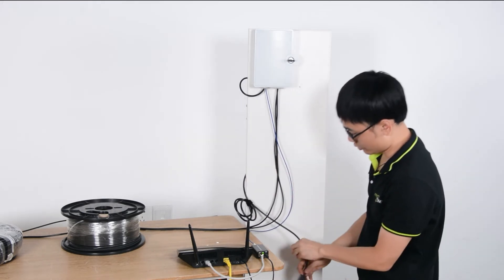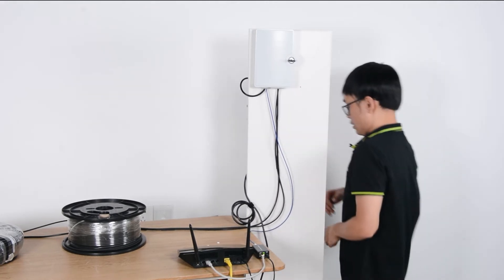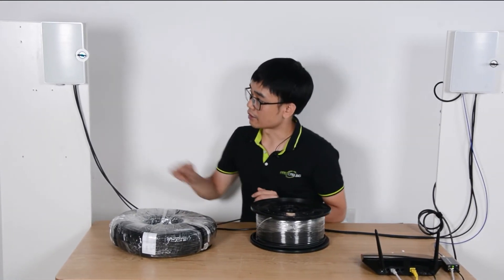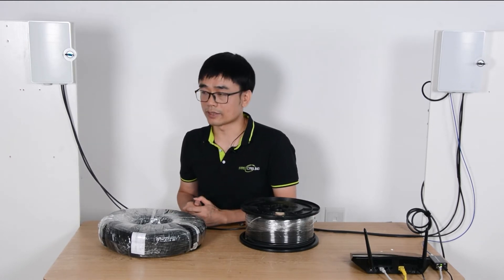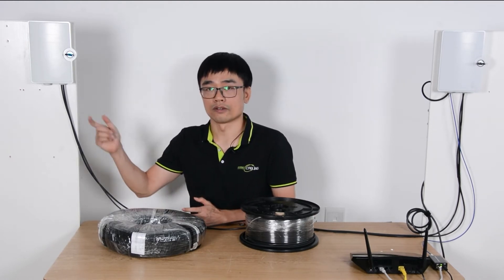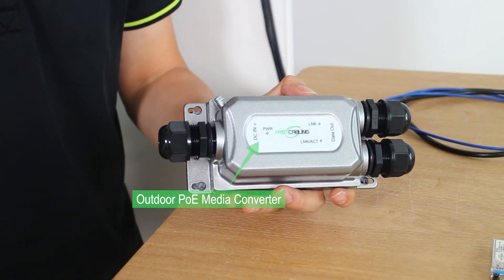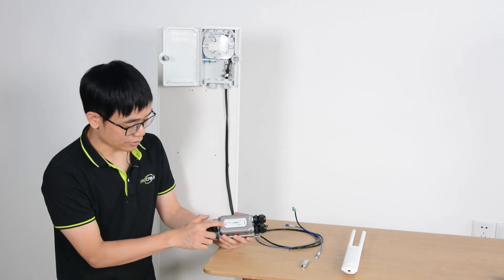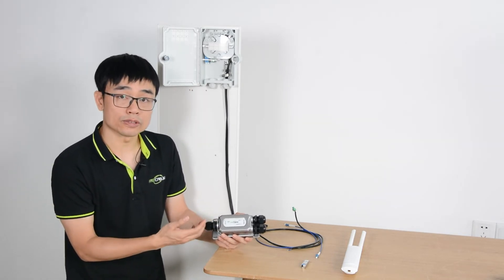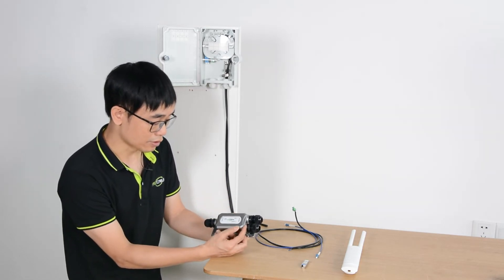Now I just need to plug this power cord into the AC power outlet. Now we have both power and data ready at the edge. In the next step, I'm going to install the IP device by taking both power and data from the second terminal box. This outdoor media converter can take data from the fiber optic cable, as well as power input to the DC input. There is a voltage regulator built in, so even if there is a voltage drop, the output can still deliver standard PoE.